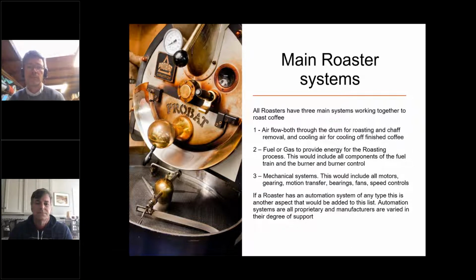Also wipe out, I run a zero, like an air cycle through the pneumatic, and I also wipe out the hopper because I've had water condensation drip onto my beans and ruin a roast. So be careful with the lowering. It looks shiny and new, but you have to clean it, as with all of them. Absolutely. I'm going to move along before Highland smacks my butt onto main roaster systems.